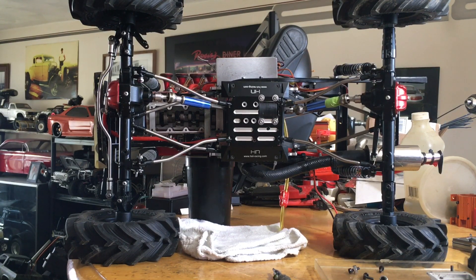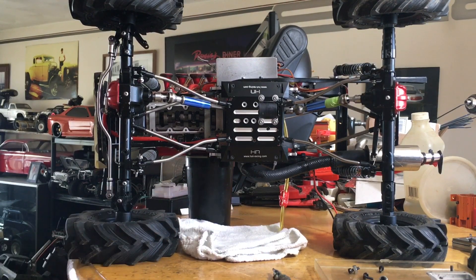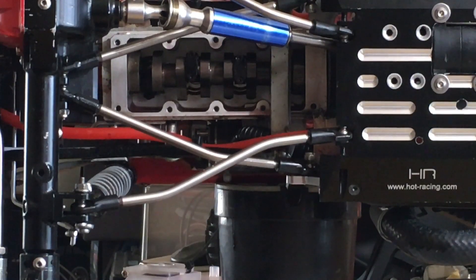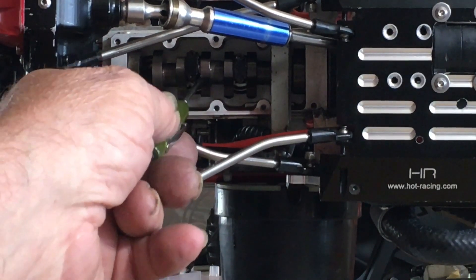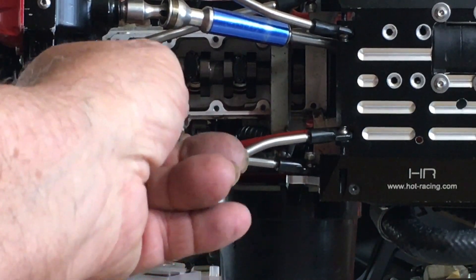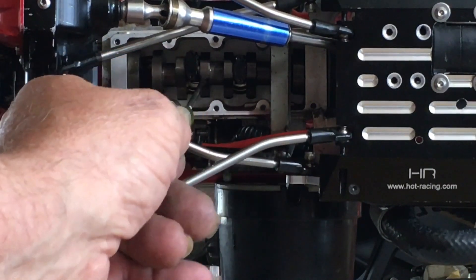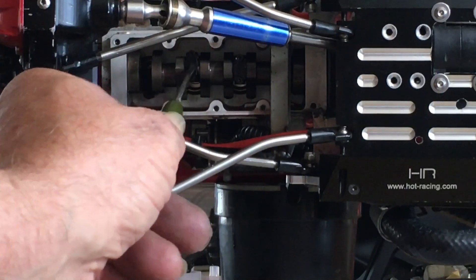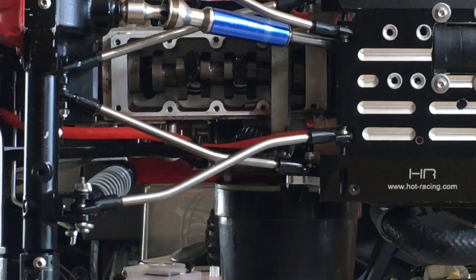I figured I had a crankshaft failure. So it's broken — I'll zoom in on it here. Right there, right in the middle, just where they all break. You'll be able to see the crank moving around in between that rod right there. This side's connected on the journal and it's broke right here, right in the center — same place as my last one broke.